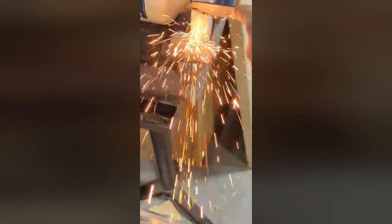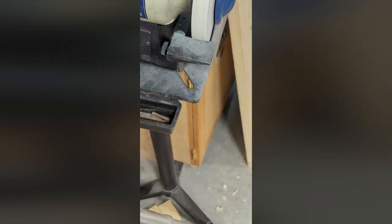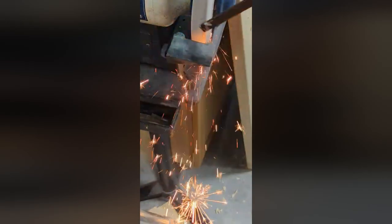No sparks at the end of the spark — sparks just happen, they don't blow up. High carbon steel — at the end of the spark, they make little sparklers. The grind test.